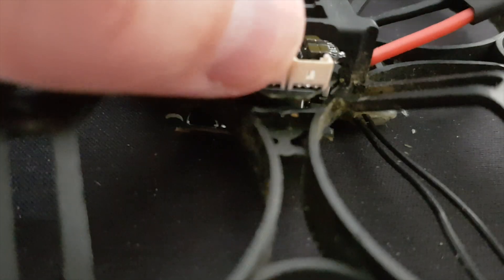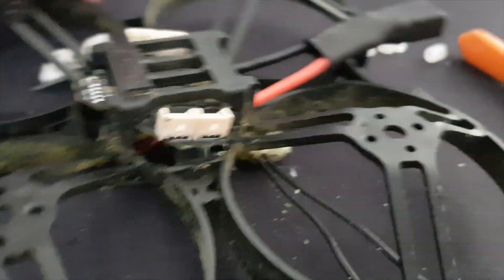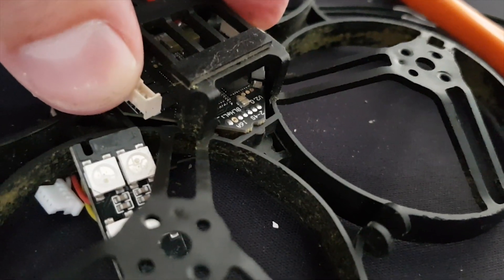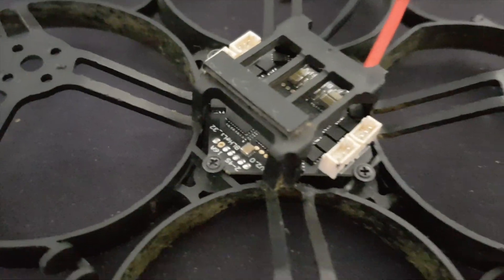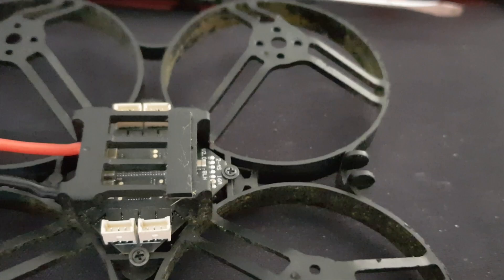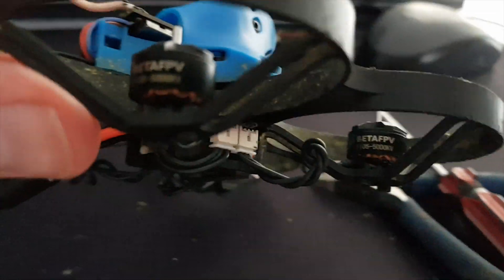When I tried to mount it, you have to pass the ESC board below the frame, but there is nothing to plug the ESC board into. The ESC board must be mounted on the frame with some spacing to allow airflow for cooling — that was the role of the pins, but now there are no pins. The trick I found was to pierce holes in the plastic frame in order to screw the boards inside in a reverse position.